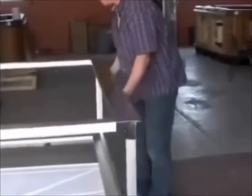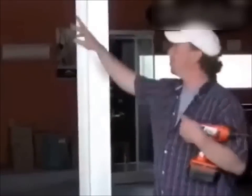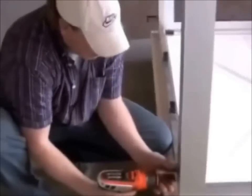Once we have it assembled, we're just going to set it down. Get some cleaner and a rag — make sure these gaskets are centered and there's no foreign particles or dirt on them. Note on the profiles on these angle pieces so it'll sit down in there. You've got your 4x20 screws, and we're going to screw tops and bottoms all into place. Once the frame is secured together, I'm going to mount the stoppers on the back.